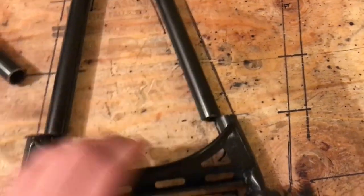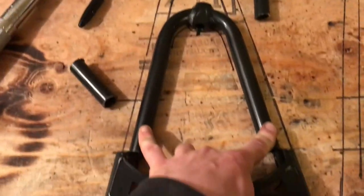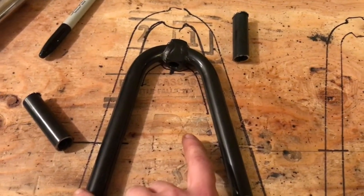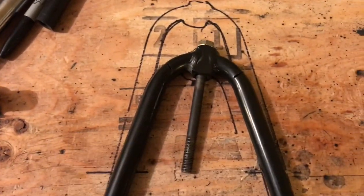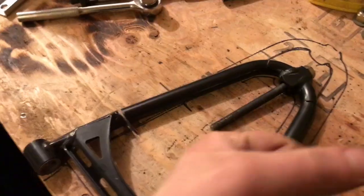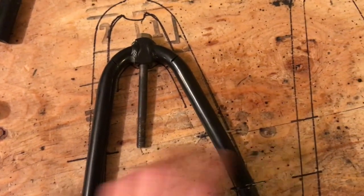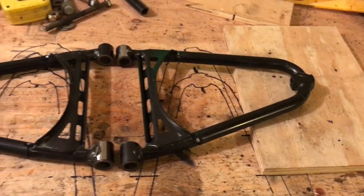The next step is to position everything where it's going to be in the final configuration — set it there, line it up, then make marks so that when you spread these bars out, this stays in the same place. We're going to pie cut here and here in order to spread them apart. All you have to do is make just a little slice, then thread a big long bolt through to give you a leverage point. You can spread them out as wide as they go and then compress them back in until they are the same width as they started.